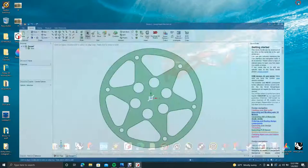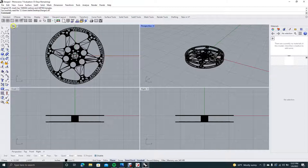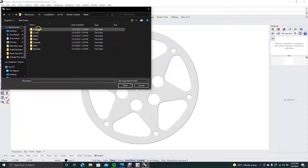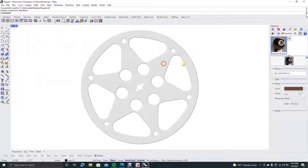What we're also going to do is give it a texture in Rhino. We'll drag this STL file on top of Rhino and say okay. Double-click on the top so it's one plane, change the view to Rendered, grab a color by hitting the plus, and double-click on Import from Material Library. We'll grab a metal — let's say Burnished Bronze. Click and drag it over — doesn't look too bad.